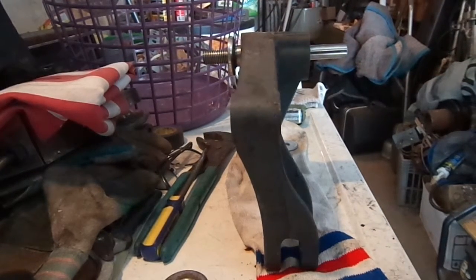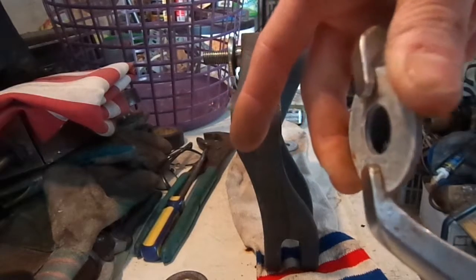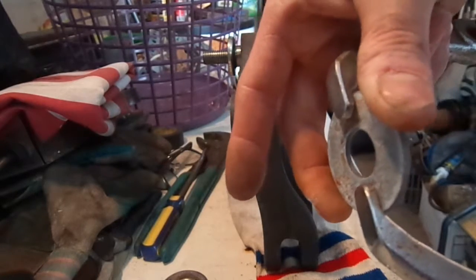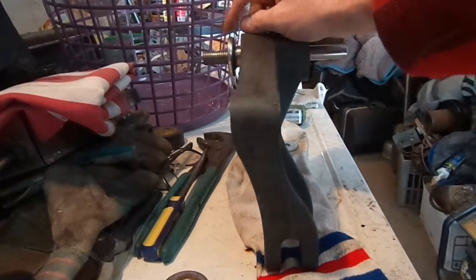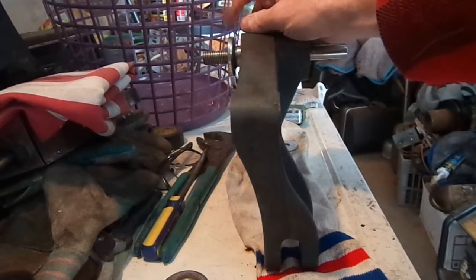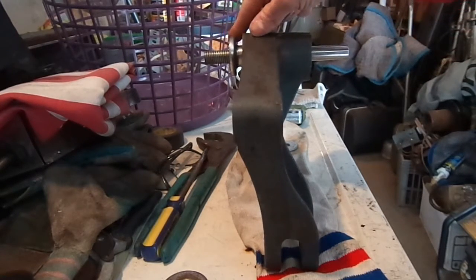and this pulls on the washer just perfectly. It's hard to hold, but you can see like that, and it just slides right on. Probably a 3-jawed puller would be nicer, but it sat flat and everything. It didn't flex. So, and then your flange collar, which you have to pull that off when you're changing the bearings. And some of these saws, not this particular model, but some of them have a little pin that goes all the way through to, I guess, keep that from falling off.